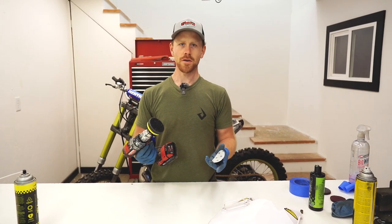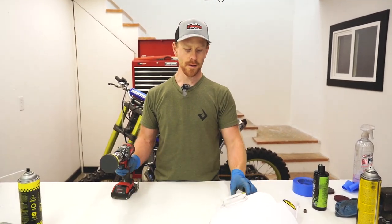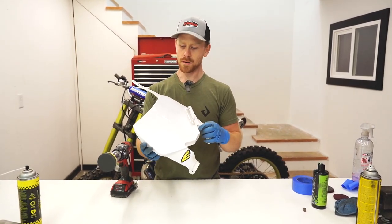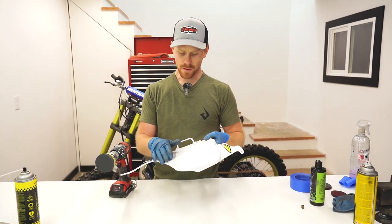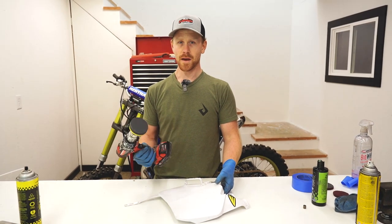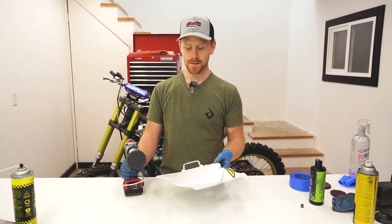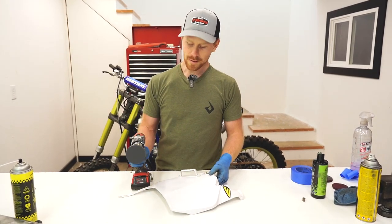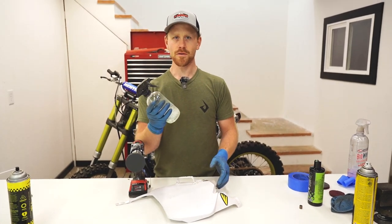You can use sandpaper on many different materials, such as plastics and wood. We're going to sand this piece of plastic here — there are some scratches and pits, but they're honestly not bad, so I'm going to start with 400 grit. If you have really deep scratches, you're going to want to start with 320 on plastics. And when you're sanding plastics, you're going to want to use soapy water.